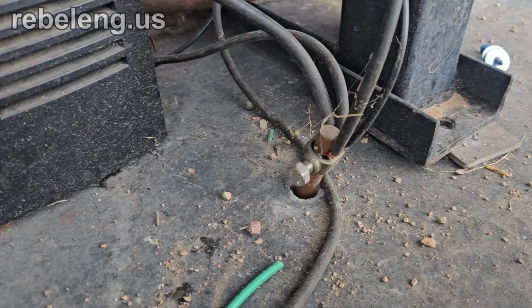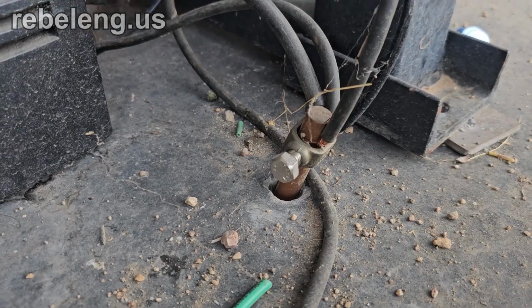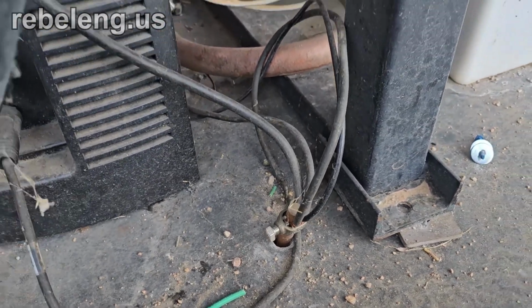By using this spark technology, it allowed for the elimination of the high frequency and the development of a new generation of low-cost CNC plasma cutting machines that can use standard computers without the special shielding, grounding, and electronics hardening. As I show here, my CNC table with the blowback ignition does have its own dedicated grounding rod. However, this is pretty minimal compared to what is required for a high frequency unit.